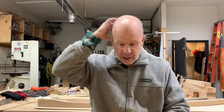And what the center lines are also going to help you with later down the road, you're going to be bringing machinery into this. It's going to help you size your blanks, a whole bunch of stuff, like even on the router duplicator, it's going to help you find center axes instead of center of the board. There's a big difference in that.